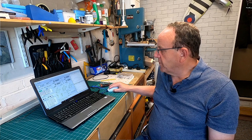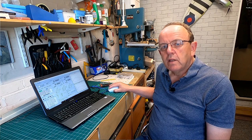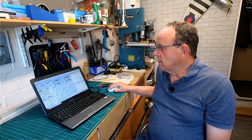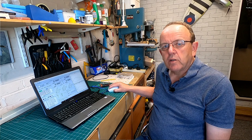So hopefully that looks a little bit better than the older version. I have tested it with code from DevWing Foam, where it's using G93 inverse feed mode, and it works absolutely fine. So I think it's a bit more suited to foam cutting, and hopefully it should be useful to you.